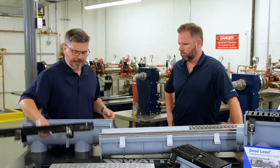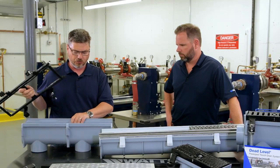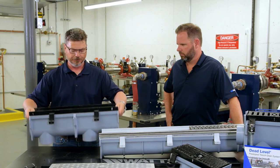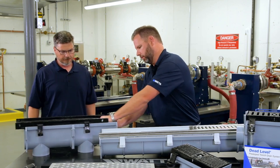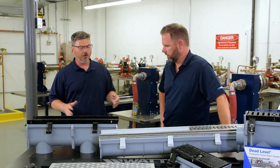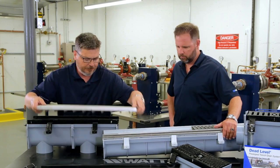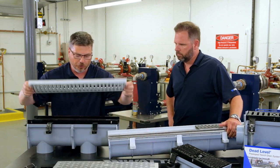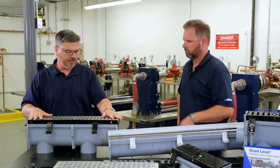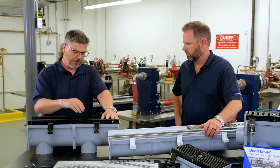So we took that, listened to it, and when we designed this — this is a ductile iron frame — we made a locking ductile iron frame that interlocks with our polypropylene trench. It slides over and locks together. You could pop it in there and actually orchestrate the whole thing. Slide it in, and this alone — you can make your pour, nothing else needed. Because this is interlocked to the plastic channel, our grates — whether stainless steel reinforced, polypropylene plastic, swimming pools, stainless steel galvanized — all fit in the same channel. No need for cutting plywood, no need for holding that form, because that's handled by our interlocking frame to the polypropylene trench.